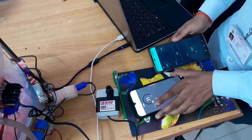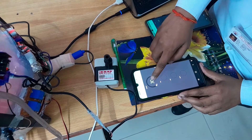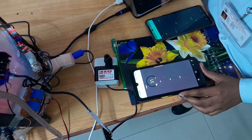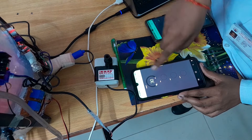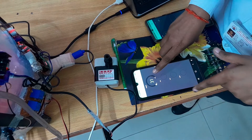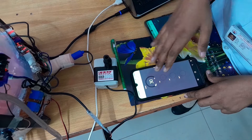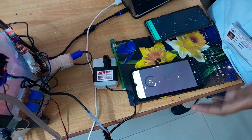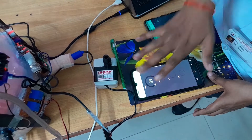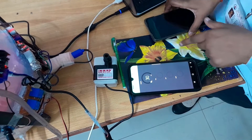The second NodeMCU display shows turbidity. The turbidity is sensed by an IR sensor. The value is shown here. When there is no medium, it is showing 30. When water is added to the tank, this value decreases. When there is some obstacle between the transmitter and receiver, and when turbidity increases, the value further decreases. This allows us to know the turbidity level and accordingly start the cleaning process.